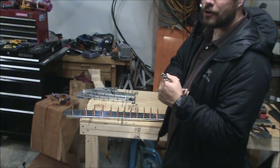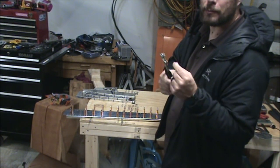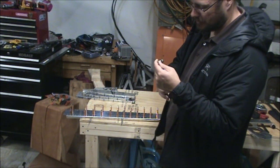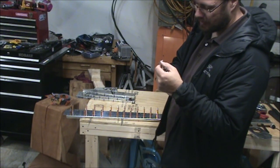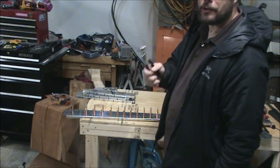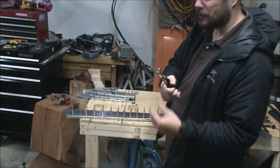These are the ones from ATS, Cleco Lock. I want to say those are the ones that are real tight fitting in those punched holes. In fact, there's been a couple holes I haven't been able to fit these into. And even after I match drilled, I've had trouble getting these into the match drilled hole.